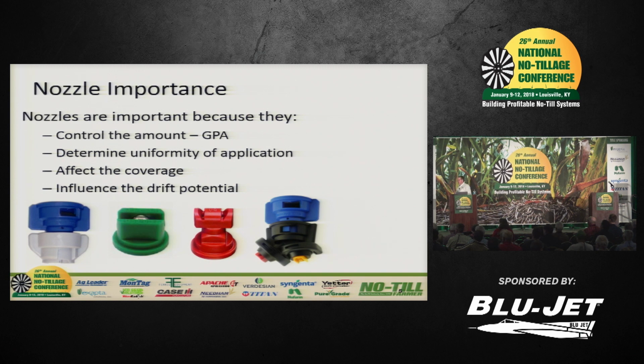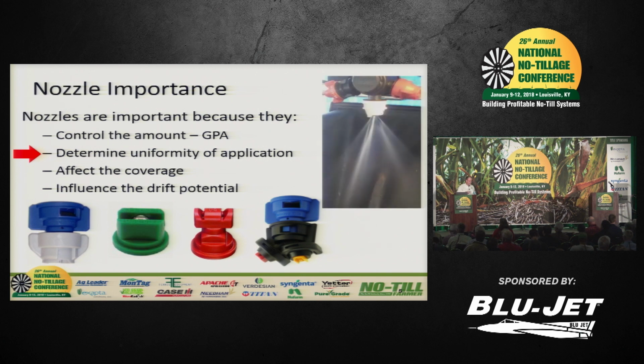Okay, why are nozzles important? Well, I've got 4 things on this list. Number 1, we put the nozzle on that sprayer, we select it for the job we're doing based on the gallons per acre that we need. And then number 2, and very importantly, it has to be done in a way that will be uniform. In other words, we have to have a little bit of nozzle observation to know that it's good and not a bad spray pattern. And that will mess with the coverage and uniformity. The last 2 things on the list are coverage and drift. And those are kind of the 2 things I'll focus on here in this talk as we go through the